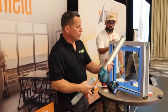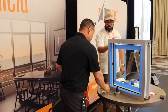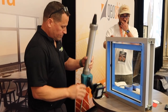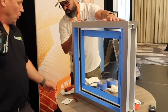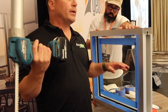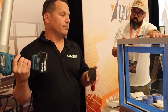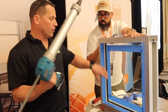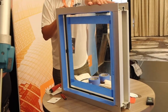I use these Makitas because you can actually load and unload these without having to pull the trigger back, and the Makita is probably one of the fastest electric-driven caulk guns. I use air power for a lot of my big projects. So when I caulk this, I'm going to try to leave like an eighth inch light gap — that's how big I want my bead. I want this trowel to barely touch the very top of that caulk for minimum waste, and it's just going to be easier to trowel it and smooth it out across the tape. The rounded part of the trowel is called the fillet — this is sheerly cosmetic. The 13/16ths is the hypotenuse plane. Everything is designed around that hypotenuse. I normally do sides, bottom and side. If you do a really large window on a hot day and you caulk the top and bottom and change your caulk out and keep going, you get a chance of that coming down.